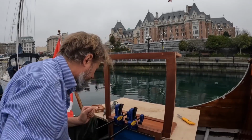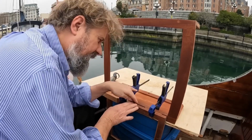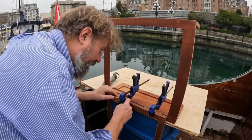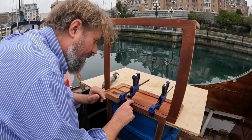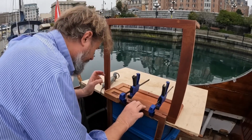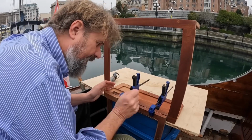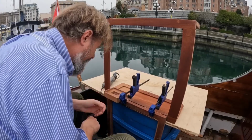Perfect. Okay, then, well, at least one small complication. The test wood that I used up in Genoa Bay was slightly thicker, even though it still was dressed to 3/4. So I actually now have to put tiny spacers in to make sure that the jig centers properly on these, which is fine. There's no harm having a tiny space here. A little more of the barrel of the hinge will stick outside. That is just fine. The other thing I have to do is make sure I absolutely nail where these hinges go, where I'd already cut out with the knife, so that I don't have a little mark around it. So I think I'm in pretty good shape, and time will tell.